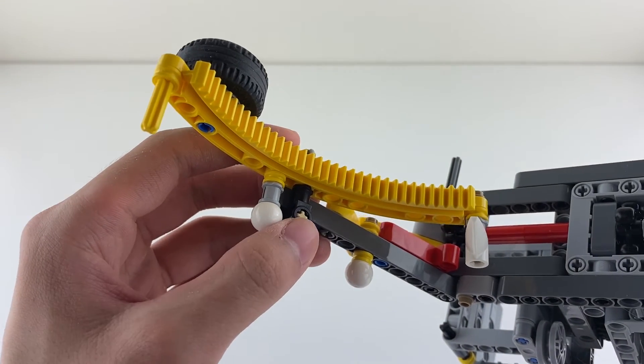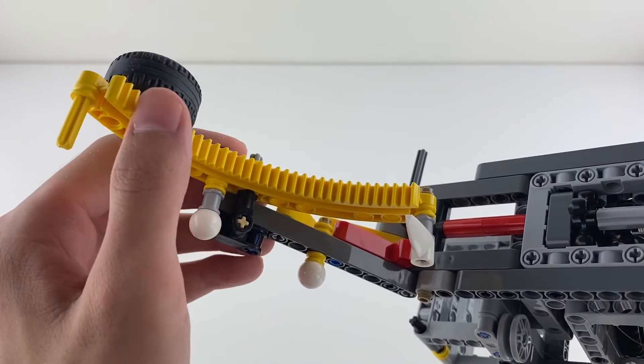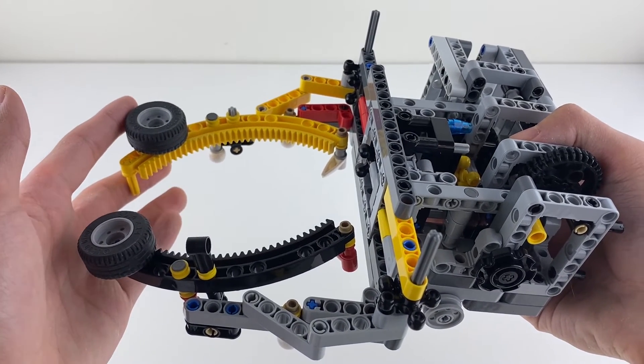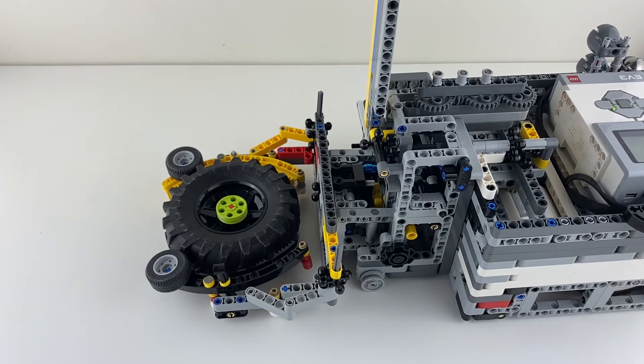You may notice that the hinge is actually below the arc piece — up here is the arc piece and down here is the hinge. The hinges below the arc pieces, along with the wheels on top of the arc pieces, cause imbalance. Watch how, as the claw is lifted up, this imbalance causes gravity to flip the arc pieces and flip the tire.